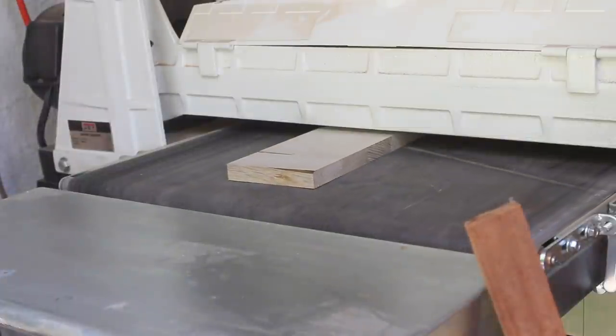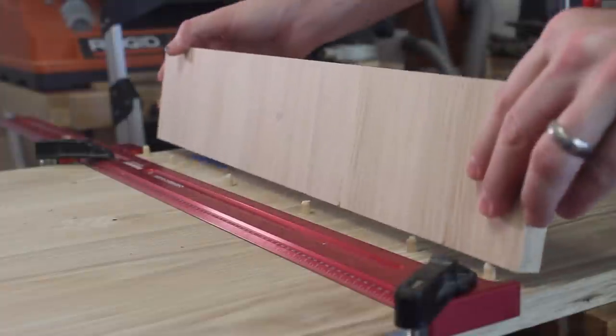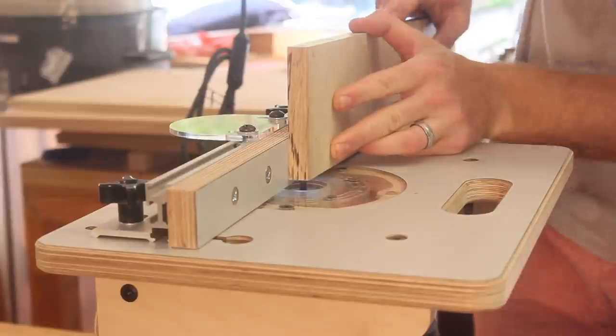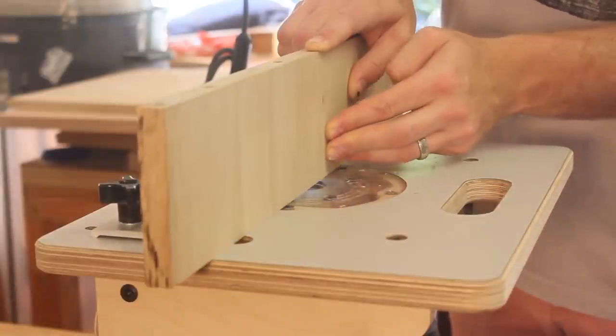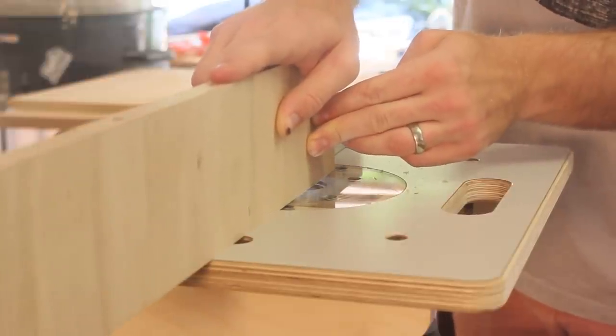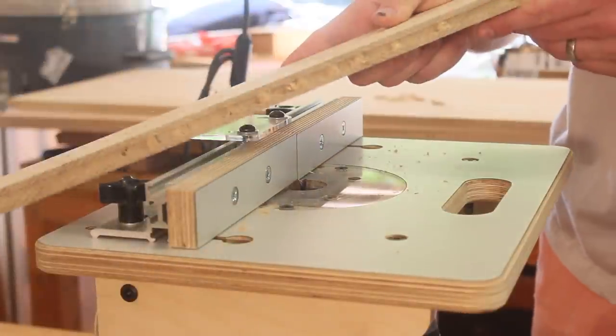Luckily, I had enough material left over to make the short divider. This was a glue-up of 10 or 12 narrow pieces which allowed me to keep proper grain orientation with the rest of the table. My initial plan was to drill quarter-inch dowels into this piece, the long divider, and the top panel. But after doing so and trying a test fit, something was out of alignment and I did not get any video of it, so I do apologize for that.